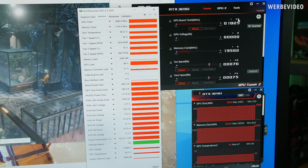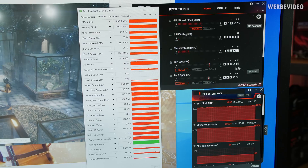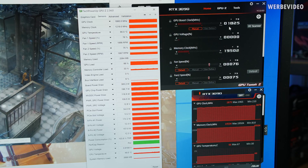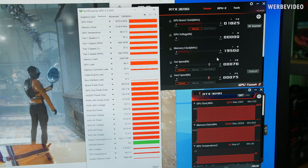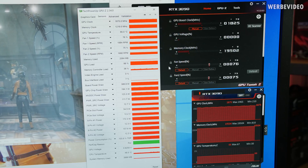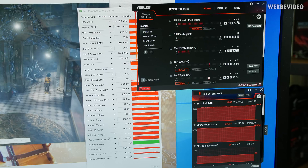Back to the start: GPU boost plus 70, power target 105%, GPU temperature target 91 degrees Celsius — that was the initial maximum stable overclock with stock capacitors, and after removing the big caps it crashed within 30 seconds to one minute. Now with the MLCCs installed, it has been running for over 25 minutes. That's looking promising. I think we can skip this step and check what happens if we go to plus 80, plus 90, maybe plus 100. I've adjusted the GPU clock to plus 100.